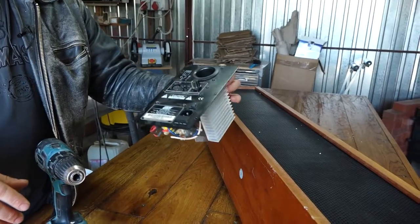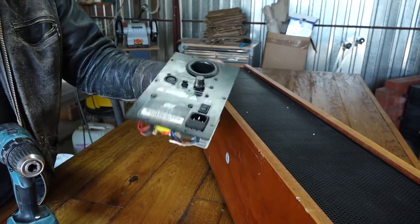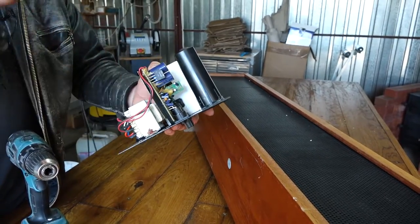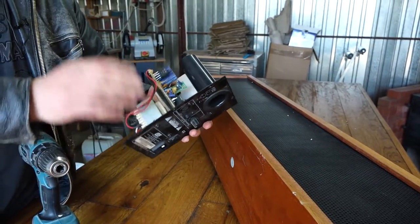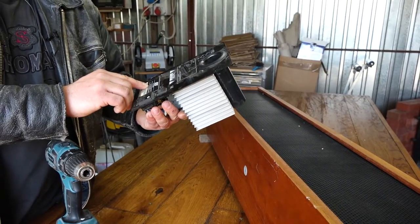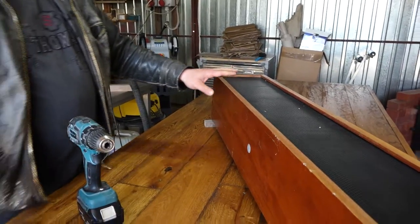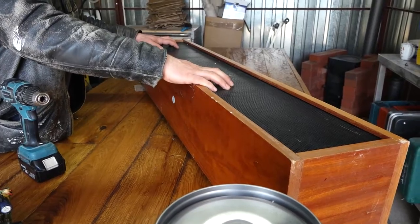Somebody dropped out this ESI N-Air 05 kind of monitor speaker. Of course, I took also the box and the speaker. This is really garbage, but I found this amplifier section, it's a really nice toy. So the low frequency amp is 40 watt, the high frequency amp is 30 watt. I think this amount of power will be enough to drive these kind of speakers.